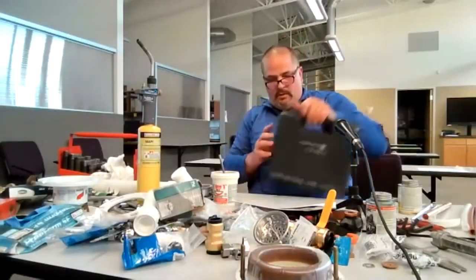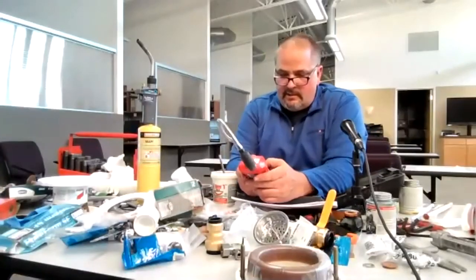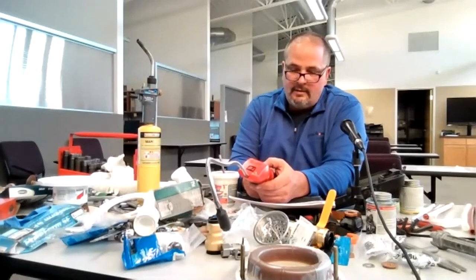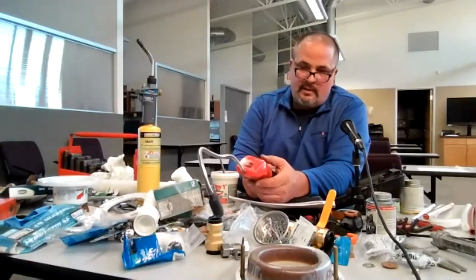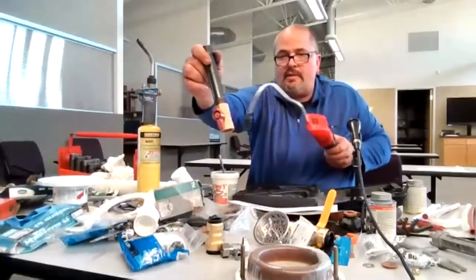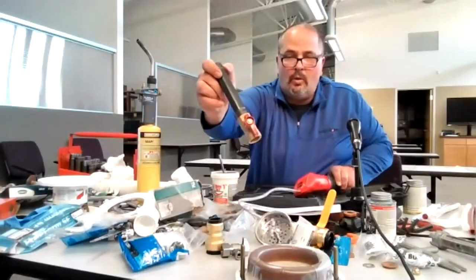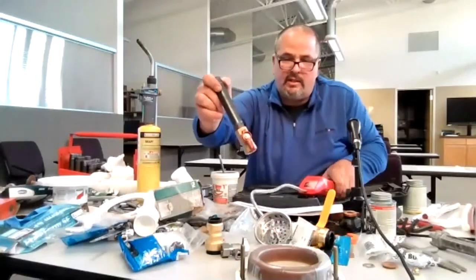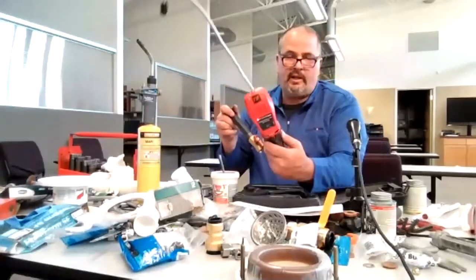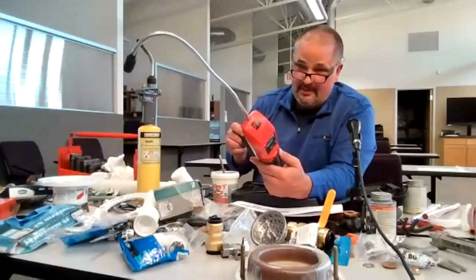I have a tool here I want to show — when I do water heaters, I've got to make sure there are no gas leaks. We just turn this gas sniffer on, let it warm up, and it can sense a gas leak. If we've got a three-quarter-inch line going down to the water heater and it's not tight, I put this sniffer right there and it'll go off because it's letting gas out. Older brass handles leak — I can put it right on the handle and it'll detect gas. The newer ones are so efficient they can actually tell if there's a gas leak when you get through the front door.